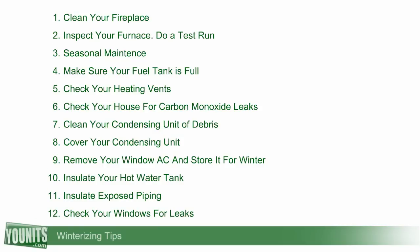Lastly, check your windows for leaks. Older double-hung style windows and gliding windows are more prone to leaks. You can cover them very inexpensively with a variety of insulation kits available at most home centers. Also check and re-caulk around those windows to make sure you have a nice tight seal.